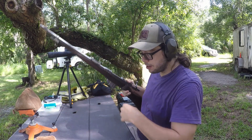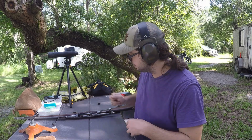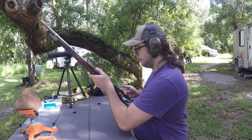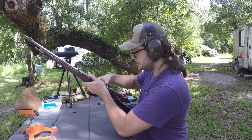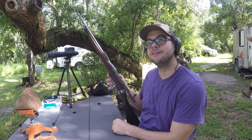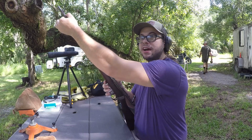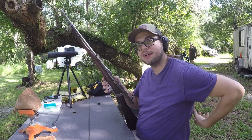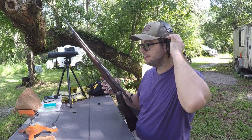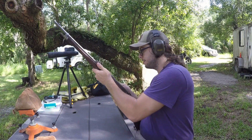I figure that I'm probably gonna have to counterbore this rifle. I did see Metford rifling inside of it, but the bore was definitely rough. Okay, well if you counterbore, then it's gonna increase the diameter, so you're gonna... Yeah, counterbore about 3 inches down the barrel. Oh, just 3 inches down. Oh, that's all. Okay. Yeah, get rid of the bad rifling at the end and cut into the better rifling. Okay. Make sense? I thought you were doing the entire length and making it into a 8mm 303 or something. Nope, I'd like to keep it 303.